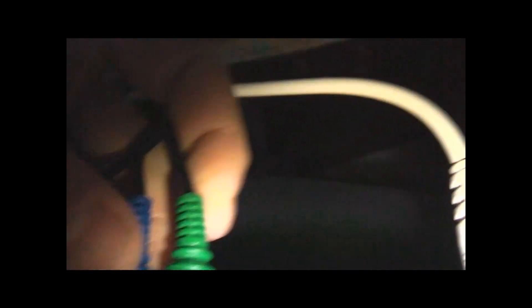The remote doesn't seem to respond — the batteries must be flat. If I tap the box, the sound breaks up. There's dry joints in the box. The picture plays up and the sound doesn't work, so if I move these, the sound will come on intermittently.